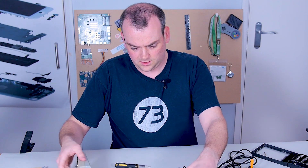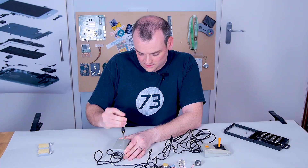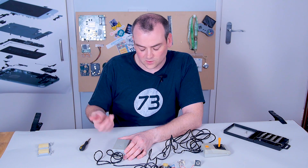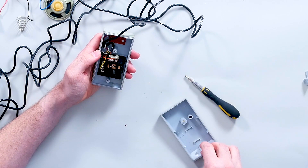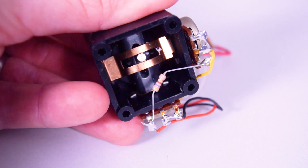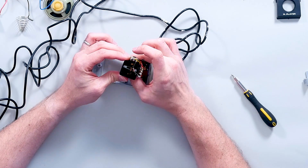Now we've seen inside the main unit, let's have a look inside the controller. As they're both physically wired in, there's no need for addressing or anything clever to identify which controller's which - they're wired permanently. I'm expecting there to be a common and then three signal wires: a left-right axis which is analogue, an up-down channel which is also analogue, and then the third button - so a four-core cable. And yes, just about the simplest joystick assembly you can get: a potentiometer for up-down, a potentiometer for left-right, with a nice little gimbal arrangement so both pots can be fixed but still get the input.